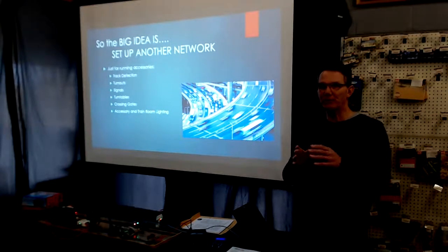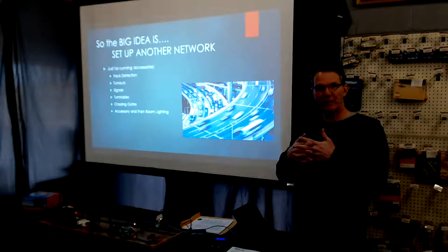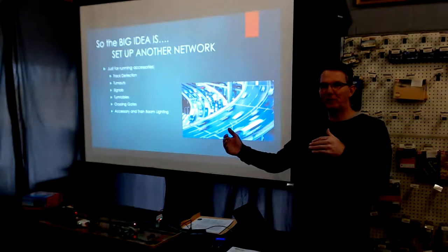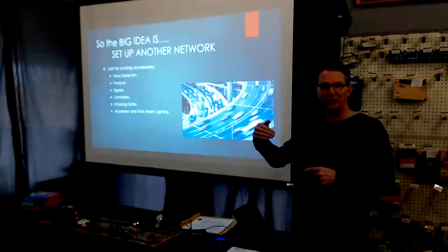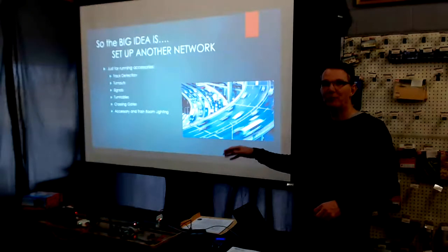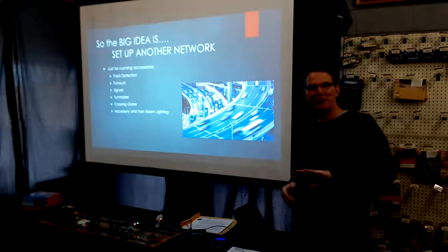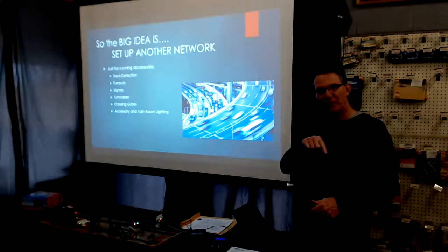There are two ways to do it. One is an LCC to DCC converter, and there are some systems that have that, for instance Digitrax has, I'm trying to think what they call their local bus. It translates the DCC into something on LocoNet. I don't know much about LocoNet, but you can bring that into JMRI. LCC can also go to JMRI, and so through that JMRI connection, you can talk between the two systems. I have an MRC system at home that also has a Wi-Fi connection into my computer, which I can run JMRI on, which I run my LCC on. You've been to my operating sessions. The turnouts on the old part of the layout are all DCC stationary decoders, and it just goes through that JMRI connection.